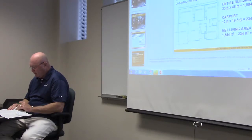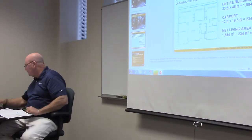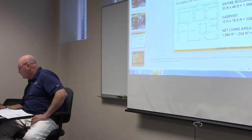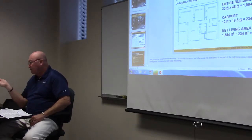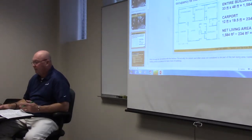Dryer load is a minimum of what? 5,000 watts, or 5 kW, whichever one you wanted to do. And where do we find that? You find that at 220.54 in your code book. Household electric dryers in a dwelling shall be either 5,000 watts or the nameplate rating, whichever is larger. So if you had 5,500 watts, the dryer would be 5,500, or 5.5 kW. If it's 4,500, it would be 5,000 or 5 kW.